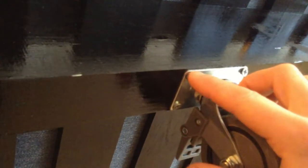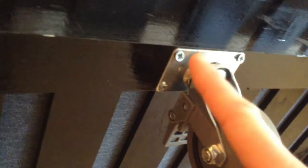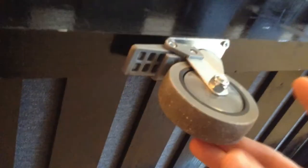Here are the caster wheels. It's important that you get a rectangular fixing plate so it fixes onto the underside of the joist nice and neat. Lots of caster wheels have square fixing plates, in which case they'll stick out the side with nothing to screw into. You can see this fixing plate is rectangular, not square, and I've screwed in at angles so the screw goes into the meat of the wood — you don't screw vertically up because then the wood would split.